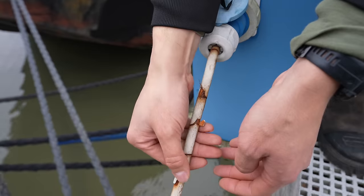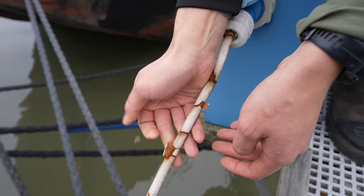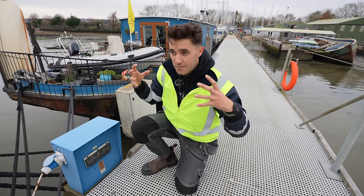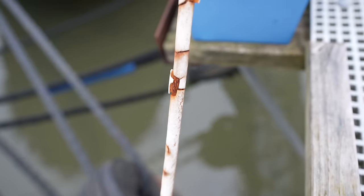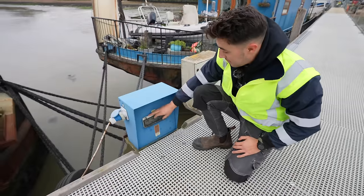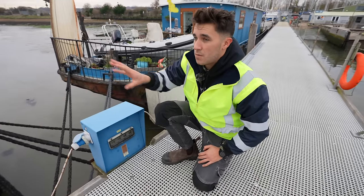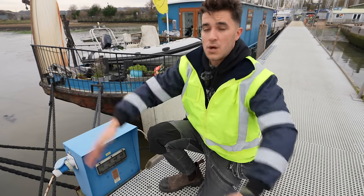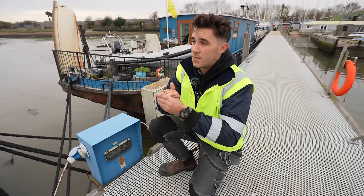You can see the state of it. This SY cable is literally just peeling off in my hands. Anything subjected to these harsh environments has to be really designed for it — as soon as you get a nick in them, the whole thing will just rust out and corrode. 16 amps is just not enough to power this whole boat, but they can't have anything bigger pulled out here because that would mean basically rewiring this whole pontoon.